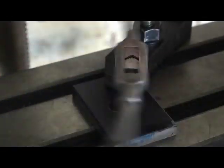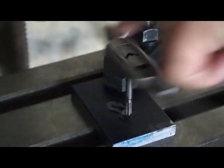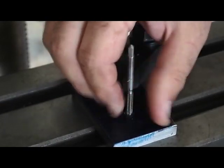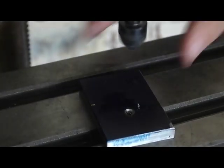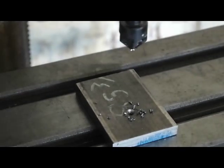You'll be able to feel when you tap all the way through the piece of metal — the tap will get easy to turn. Now I'm backing the tap out. The last step is to remove the work from the clamp. I'll put a little countersink on the other side to get rid of the burr that came from tapping. And that's it.